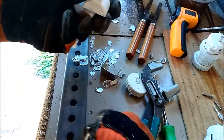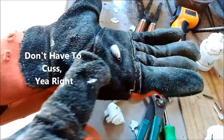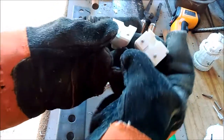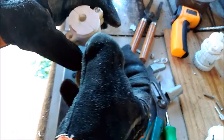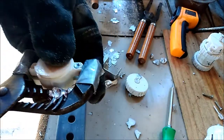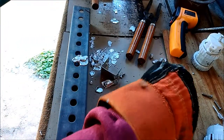Tapering that hollow point pin sure helped out a lot — they come right out, I don't have to struggle with them at all. That's a good bullet right there, provided the dimensions are correct. So far I see no erosion or striations on this particular mold. I don't know why that would be when the other ones were definitely having that effect. I'll keep going with this 9mm until I start seeing those striations. Right now I'm at number five — this will be number six.